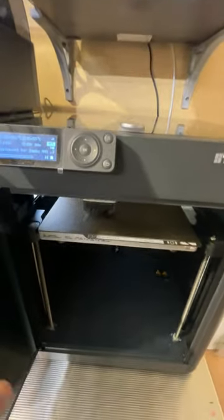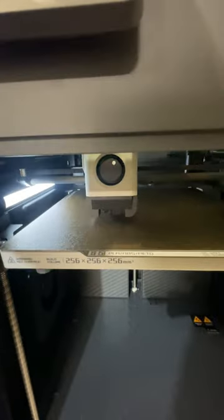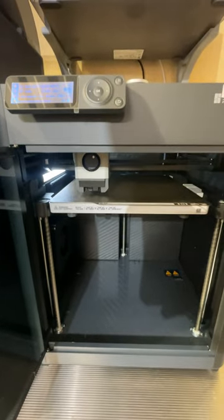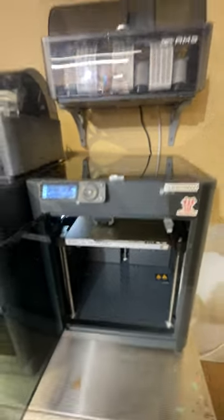You have to pull out the piece inside the extruder. When the filament breaks, it might be the case that the extruder didn't break inside, but this one did. I took out the piece from inside the hot end and left the piece inside the extruder just for you to see that no matter what you do, all the work you'll be doing you're gonna have to do twice — because if you don't check the extruder, it doesn't start, it doesn't print. I hope this helps.